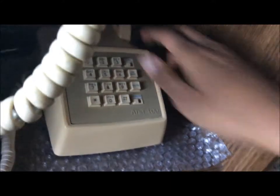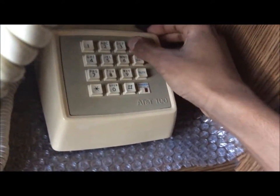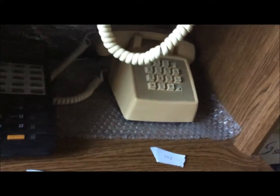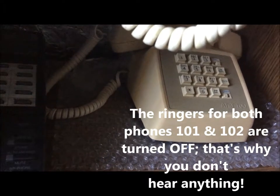Now let's test it with dial pulse. This emulates the pulses from a rotary telephone, like this one here. If you listen carefully, you can hear the pulses being sent. When you hear it ringing, you also hear clicking noises from the PBX — it's actually sending out the current for the ringing signal.